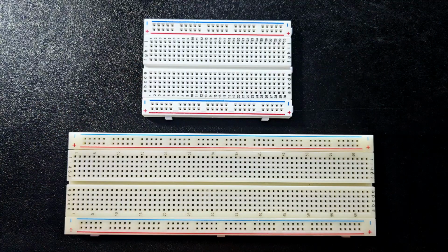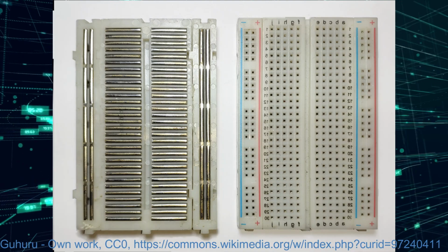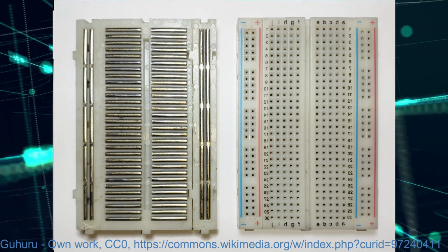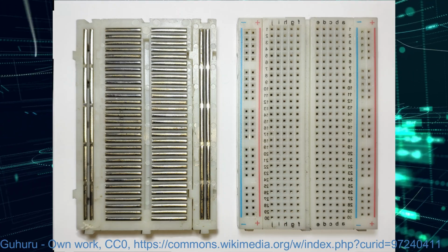Breadboards serve as an easy way to connect and hold components. The conductive parts of the breadboard allow electrons to flow through between the things you plug into it. Inside the breadboard are many strips of metal that connect the rows and columns together. The metal strips are springy so that when you poke a wire into the hole, the clips grab onto it.